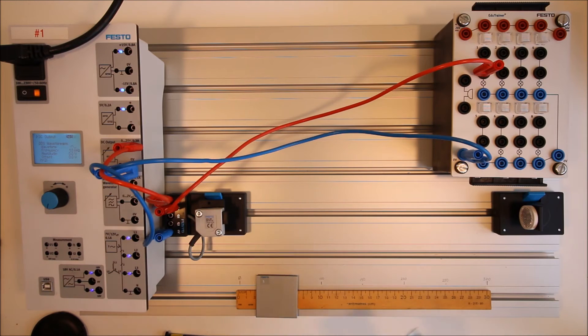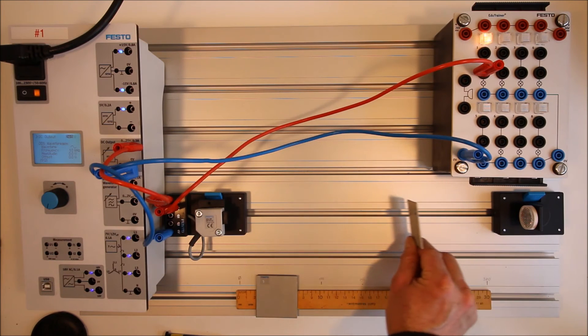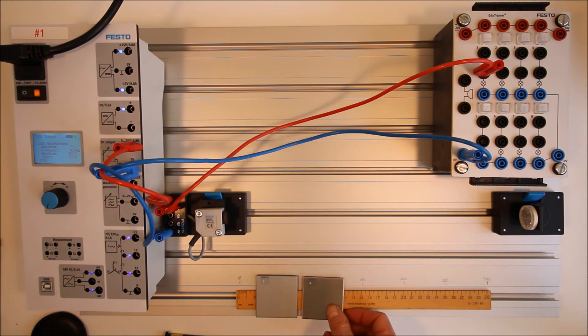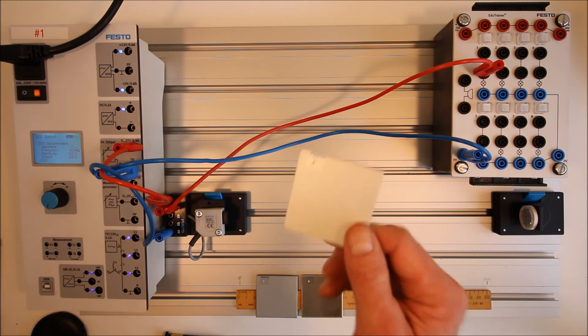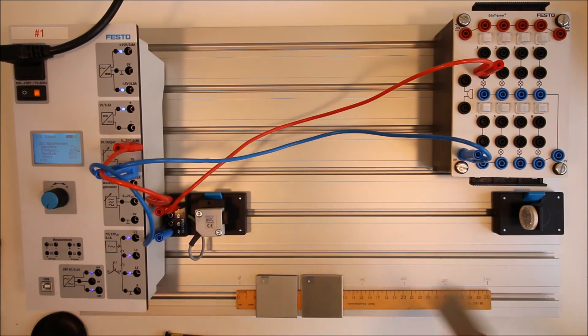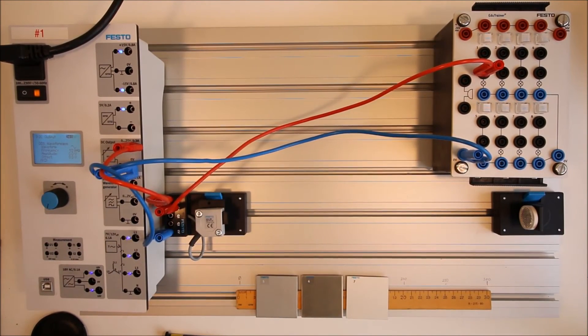With the stainless, all the way through you're getting the high output. On my sensor that means 24 volts when something is blocking it, but yours might be the opposite — high normally and low when blocked. Next is aluminum, number 7. Again, no light gets through. This is fairly intuitive — this sensor can pick up any piece of metal, which is perfect for a gate application, because as cars go through it doesn't matter what type of metal it is; it will obviously block the light.